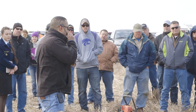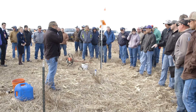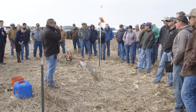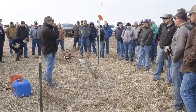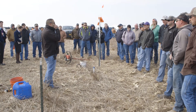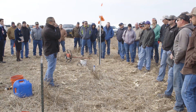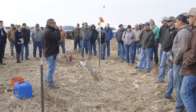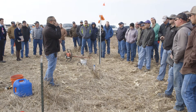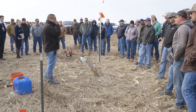It's a 48-inch probe and there's a sensor every four inches, starting at four inches all the way down to 48 inches. Each sensor is measuring not only soil moisture, but also EC — tracking bulk salts in your profile — and temperature at every level, as well as root tracking as they grow through during the season.